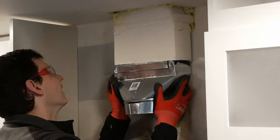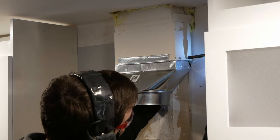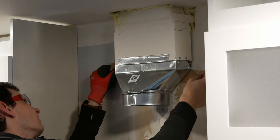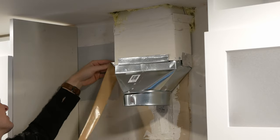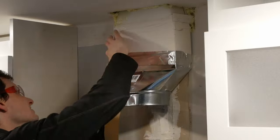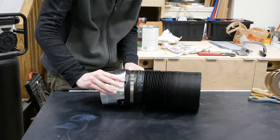I added a rectangular to 6 inch duct adapter, pre-drilled through the side going through both the duct and the adapter, and then screwed it together with sheet metal screws. To apply tape on the back side of the seam I left the paper on the tape, positioned it, stuck it in place on one side, and pulled the paper down and away with the tape adhering as I did so. Then I taped the rest of the seam as well.